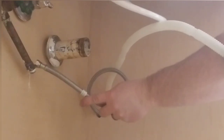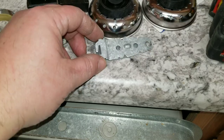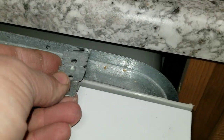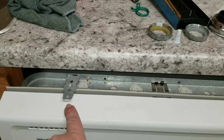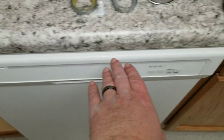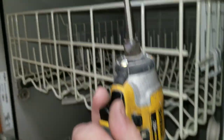You can clearly see the hose will reach the supply end here, and this one will reach right where the drains are going to go. Stop the dishwasher right at the edge of the countertop so you can install your mounting hardware. This piece flips over — get inside, push down on it, same thing on this side. There's a little slot right there, push down on it, and it will rest on top. When you slide it in where you want it, open the door, reach inside, and put a screw through each one of these holes. Line it up, get it back in place, push it up until it's nice and flush. Right there is where you put the screws in on each side. Verify that your electrical cable is still accessible. Grab two small screws and run them into place by hand. Make sure everything closes, it locks, and is nice and flush. Now we'll come down here, wire up all the electrical, and then move to the drain line.